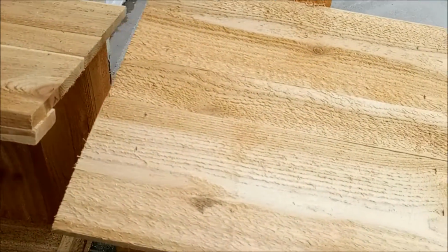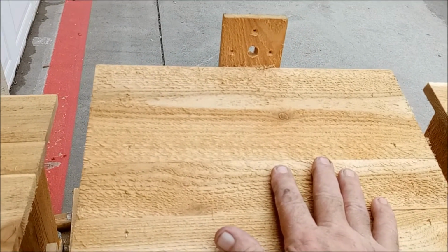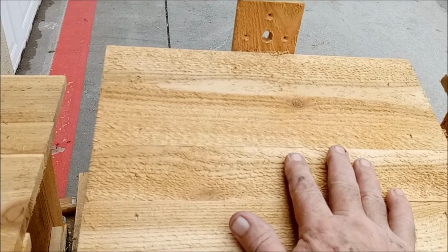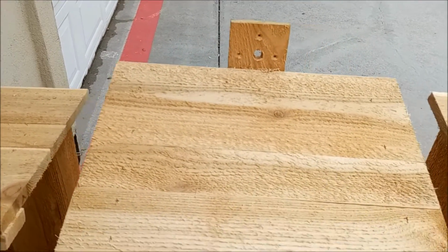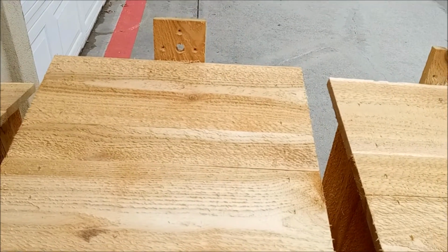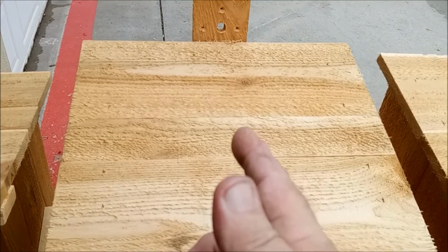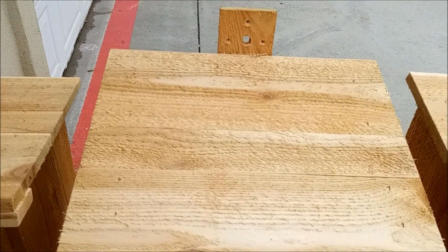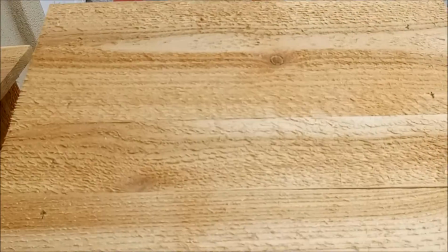They may be 3 inch sheetrock screws, 2.5 inch sheetrock screws. Those ultimately will fail on you. One, they're going to rust out, usually within a season. But two, those are so hard that they're brittle. And if you're running a sheetrock screw into a really hard tree, it'll snap the screw off before you ever get it all the way in.